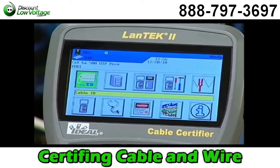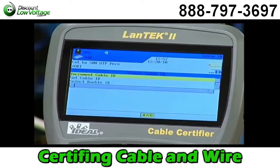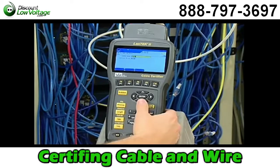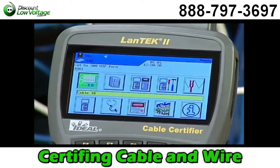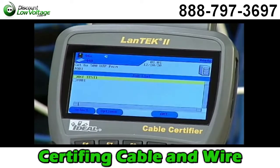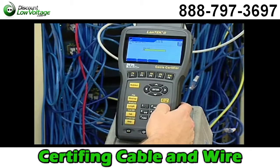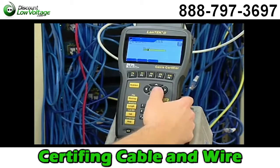Return to the Ready screen and press Enter to select Setup Cable ID. Make sure Single Cable ID is selected and then choose Set Cable ID by pressing Enter. Enter the cable name, then press the down arrow to input the current value. Next, set up a folder to store test results by highlighting the file icon and pressing Enter. The job list displays all existing folders stored in the tester. Press the Options Function key, select New Job from the list and press Enter. Create a job name relevant to the job at hand using the keypad and press Enter — it will now appear in the job folder list as the active job.